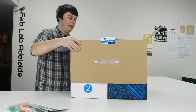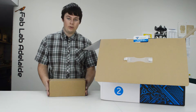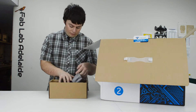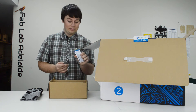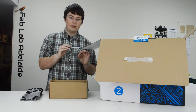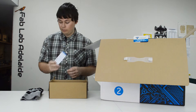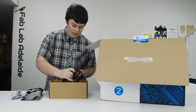There's a brown accessories box — all UP machines come with one like this. Opening it up: there's a pair of gloves, and in the top there is a calibration card. You put it underneath the nozzle, bring the nozzle down, move it, and once you feel it grabbing that indicates you're at the right height — very handy. Then we have a pair of safety goggles and the power cord to the power brick.